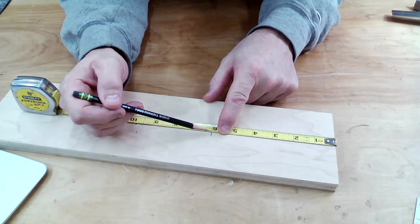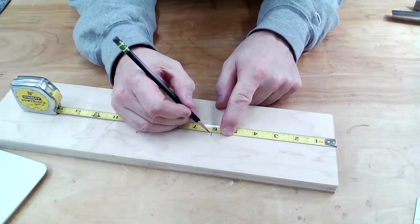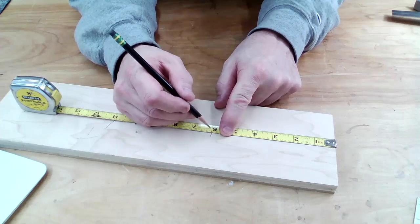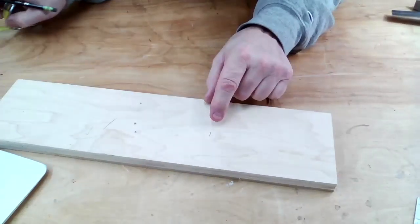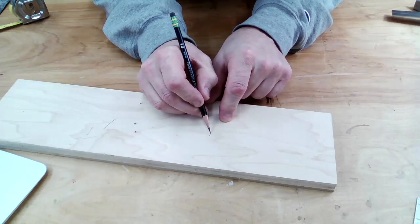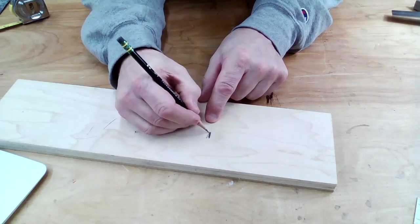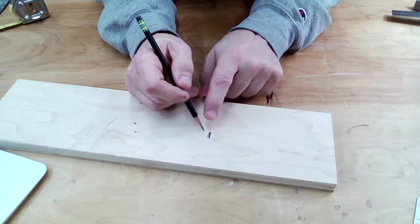Often in woodworking with furniture making, box making, or detailed woodworking - which is what we're learning in this class - a sixteenth or a thirty-second of an inch is a lot. It can throw off the joinery when joining pieces of wood together. If you're trying to make a nice square decorative box, that thick pencil mark becomes an issue. When we go to make our cut, we don't really know where the actual mark is. We want a point in space, but this line has thickness. Making it darker just makes the problem worse - the thicker and darker that mark is, the more inaccuracy you're creating.